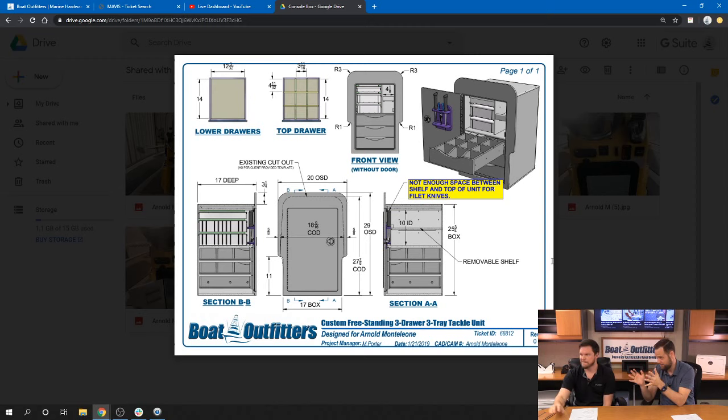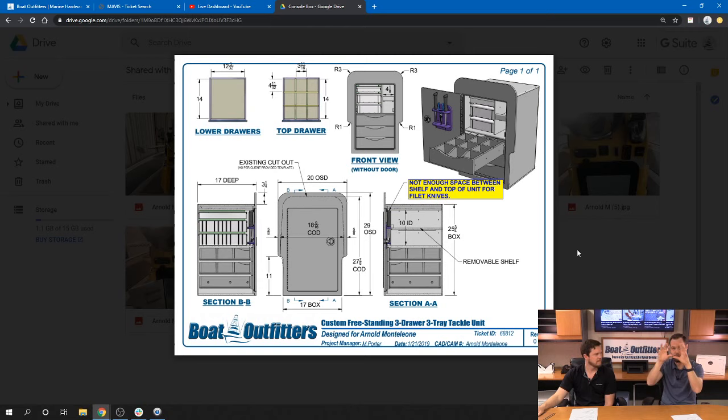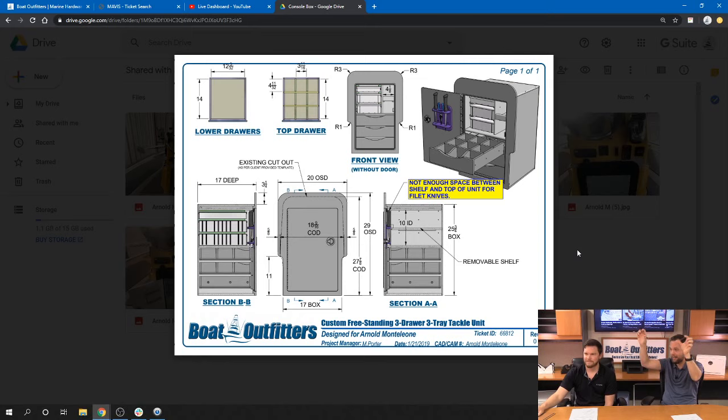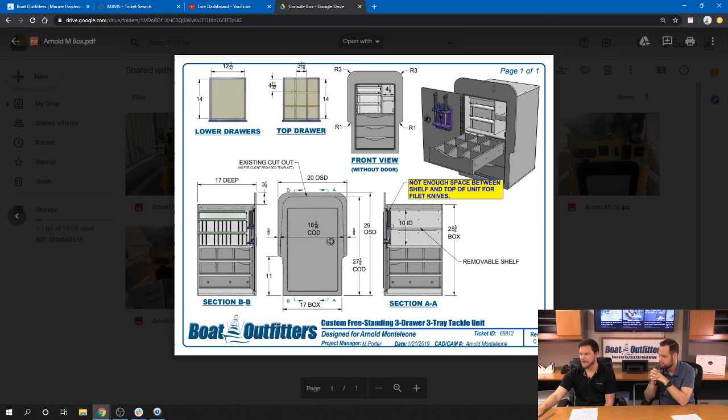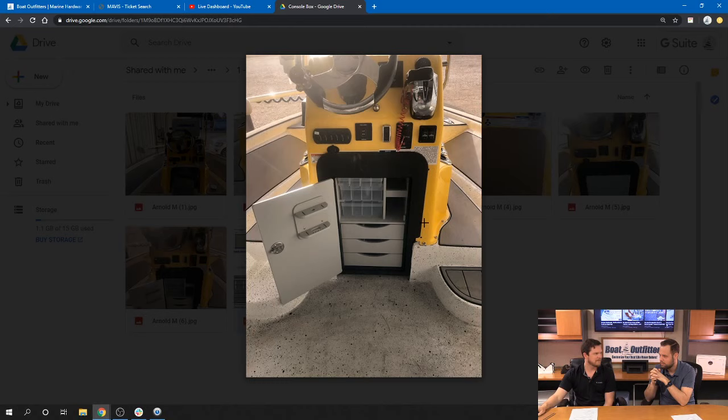So real quick, looking at what we're doing — the actual shell of the tackle box is effectively rectangular, there's no tooling in the box. It looks like we captured the unique tooling and unique space all in the frame. So it's a weird oversized frame — oversized on top and the sides, coming down to more typical on the bottom. It ties right back into our normal construction methods. The cool thing about this project is this is just our standard frame. Cutting this on the router, they just cut that extra little bit out, hogged out the material in the back of the one-inch frame so that it would cap over the fiberglass. And it not only closed it out, but it gave him the ability to mount this box just with the frame. He was able to through-bolt through access he had somewhere else in the console and put lock nuts and washers right on.